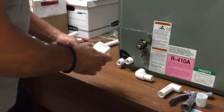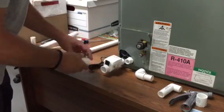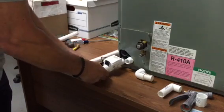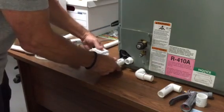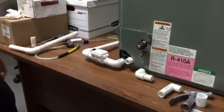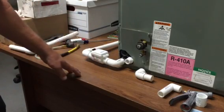The device can be installed in the primary drain line. It can come straight out of the unit and off to the side, or you can come right off of the unit and off to the side — and now you would be completely inside the drain line. You want to get as close to the air handler and drain pan as possible.